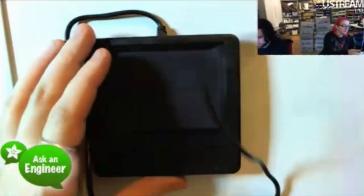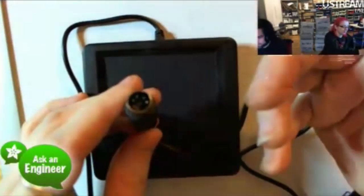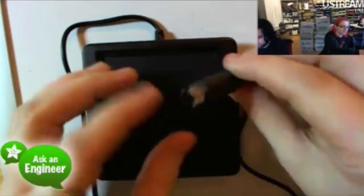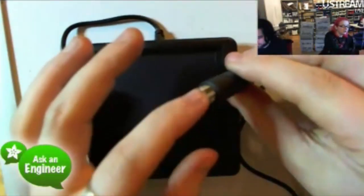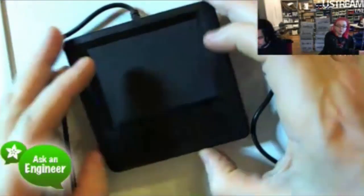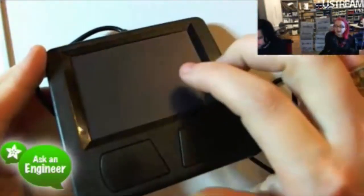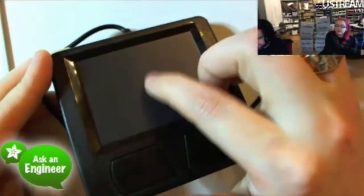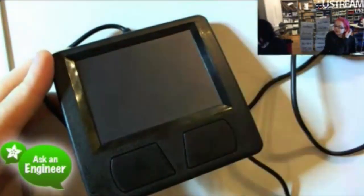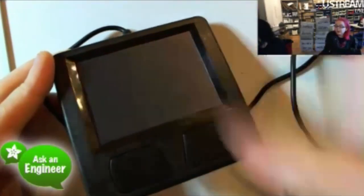like this. So we wrote a really quick PS2 library for this for Arduino, but almost any microcontroller has a PS2 library. It's really common, and using only 2 pins, data and clock, you can talk to this. And so we wrote a driver for it. The neat thing is that it's got this capacitive touch pad, and you can get absolute touch values and Z values. So I can get from 0,0 all the way to like 1,000, 1,000, I think, or like 600, 1,000. And it'll also tell you how hard you're pressing.